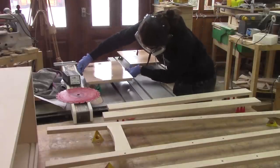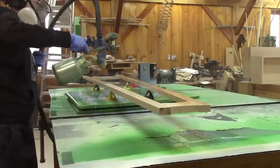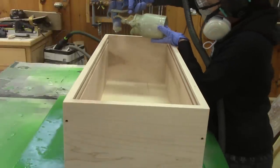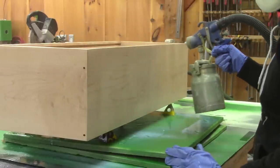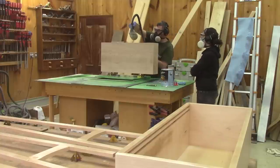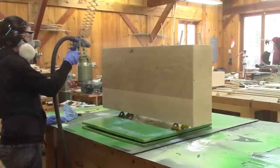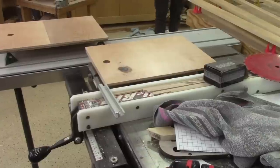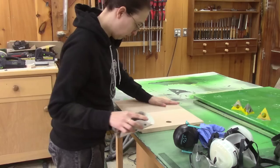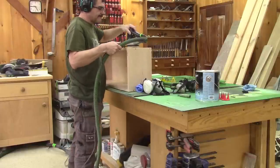When the doors are done, there are still some easy pieces left. But there are still the two other parts — I start with the big one, it's easier. When it comes to the table, I let Alain do the interior. Since there isn't a lot of space, Alain is worried I won't be able to do it since it's my first time using a spray gun. But I still get to finish the spraying of the desk. Now all that's left is to leave the varnish to dry a few hours before doing a light sanding to remove any imperfections on the finish. I take care of the smaller pieces while Alain uses the linear sander at a low speed for the big pieces.